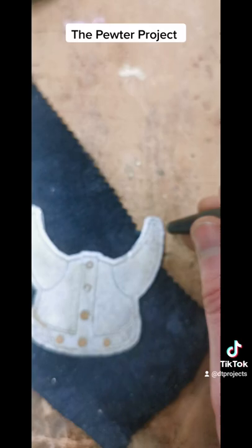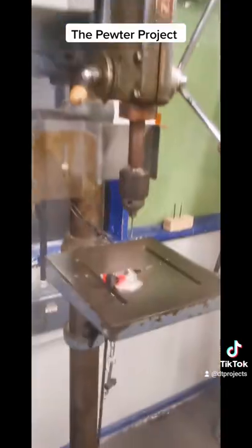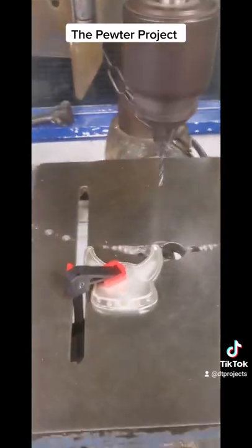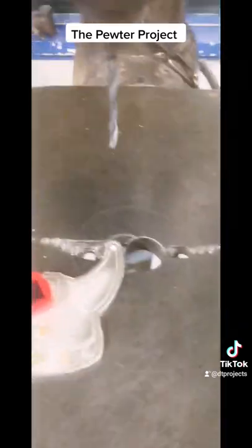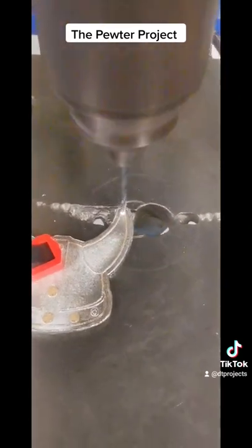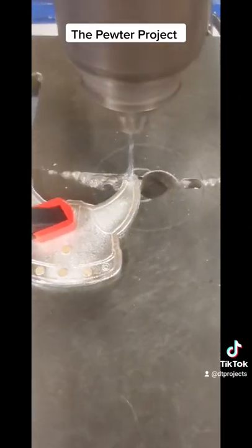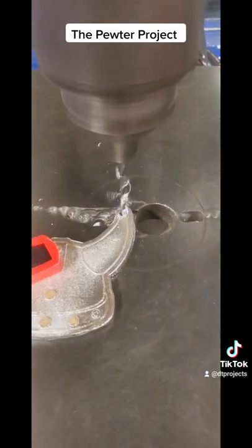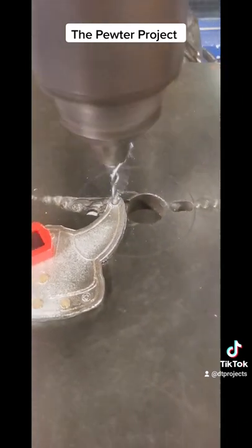This is the centre punch. We're going to use a hammer just to bang a little hole in there, and that allows the pillar drill somewhere to sit on top so that it doesn't slip out of the way. We've got our glasses on at this point, and then we're going to pull it right down and you're going to see the swarf come off — those swirly bits of metal. We don't want to touch these with our hands as they're quite sharp.